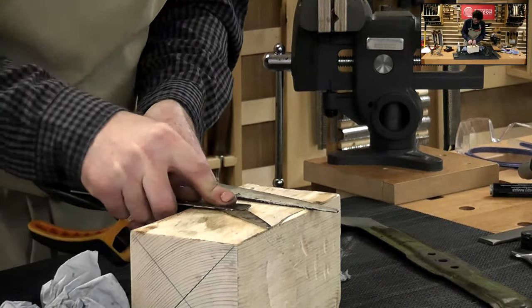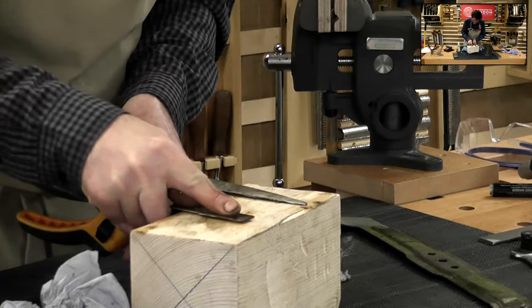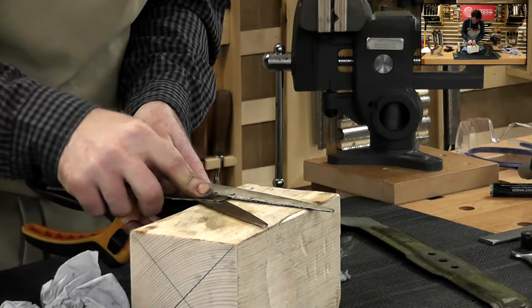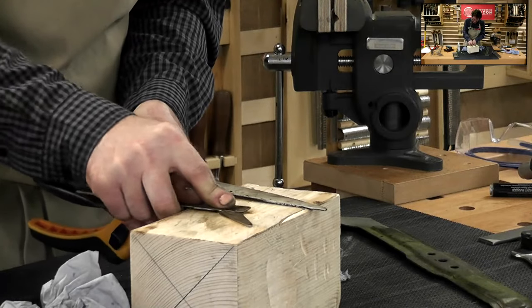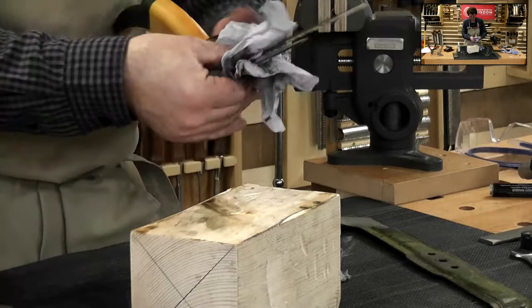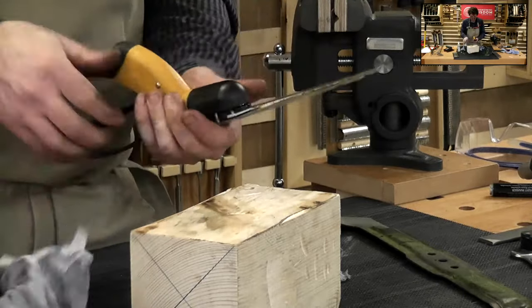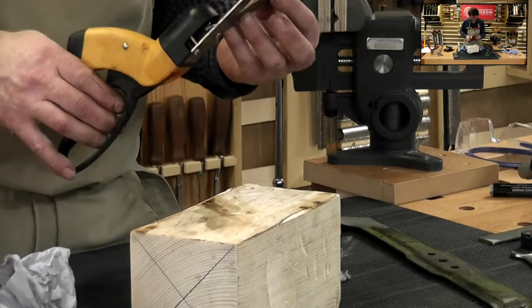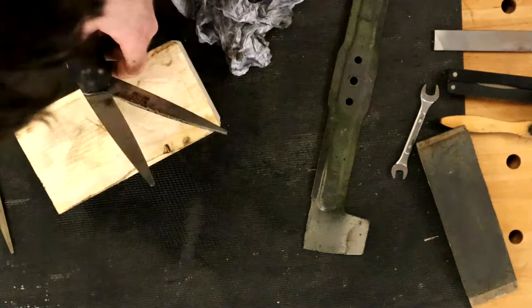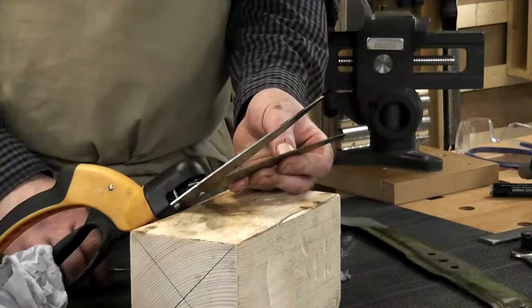Pick up the diamond file, off we go again just to do those. I don't actually need to try and touch the cutting edge, or what we would assume is the cutting edge. Let's do the easy face down in between. Okay. Again, already looking cleaner. We tighten there. I need a tiny bit if we can. I don't want to touch too much of that internal face.